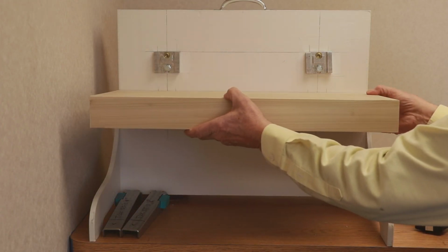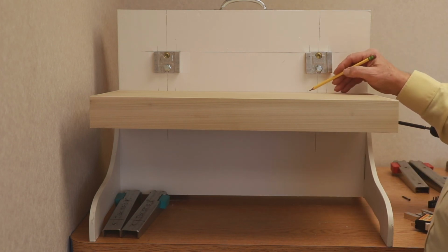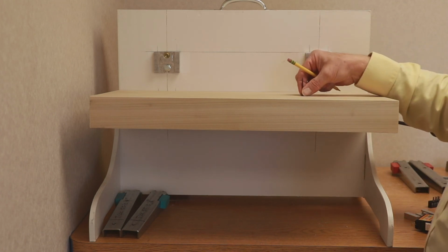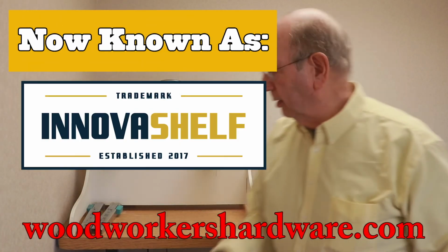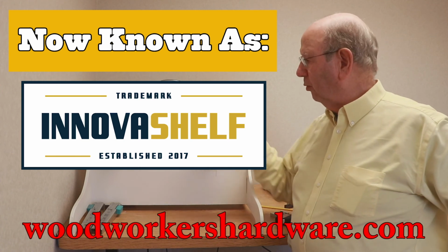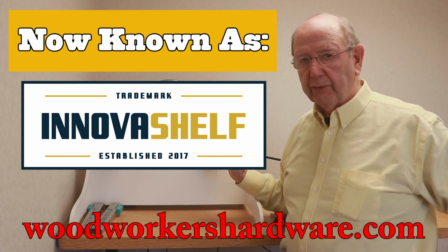Slip the shelf on. Here again you have this line that we extended. Measure out 2 inches and you can put in this little screw to keep your shelf from coming off the wall. So there you have it. Now that is the ShelfMate patented wall bracket system for floating shelves. It's a really nice one.